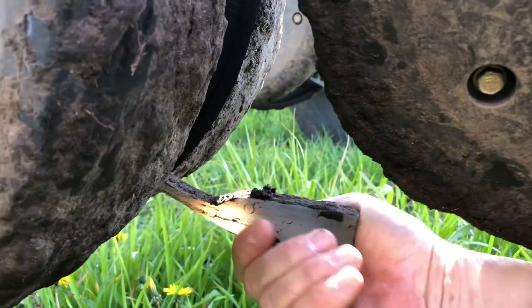We have not ever had seed firmers on our planter before, but we decided to give it a try on half of the planter this year so we can have a side-by-side trial across all of our acres on the effectiveness or ineffectiveness of seed firmers. A seed firmer is a really simple piece of equipment. All it does is glide through the furrow after the seed is dropped and just make sure that seed is pressed firmly down into the bottom of the furrow. Once in a while you'll get some seeds that get hung up before they hit the bottom of the furrow, and a quarter of an inch of depth makes a lot of difference.